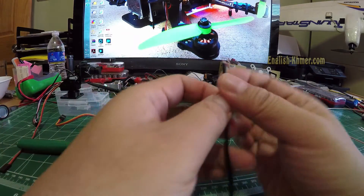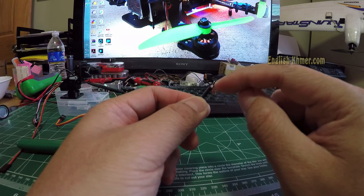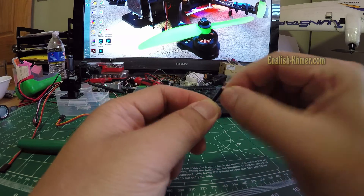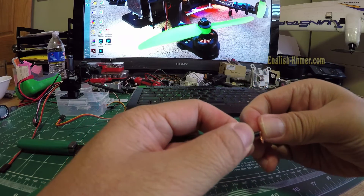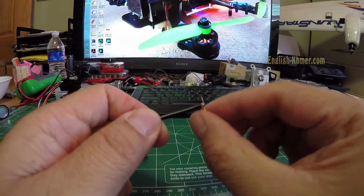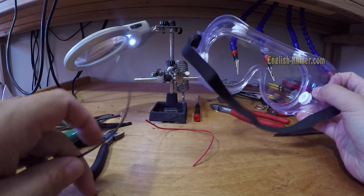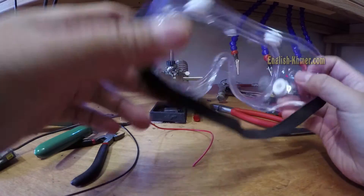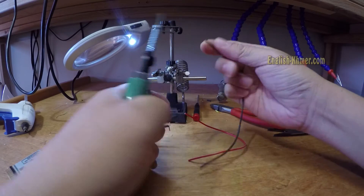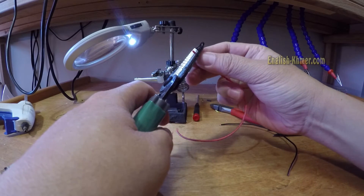Make sure that no wire is touching the active wire. I usually make it so the ground and active go in opposite directions. It's a good idea to wear goggles when you do soldering. Then trim the ground wire and trim the active wire.